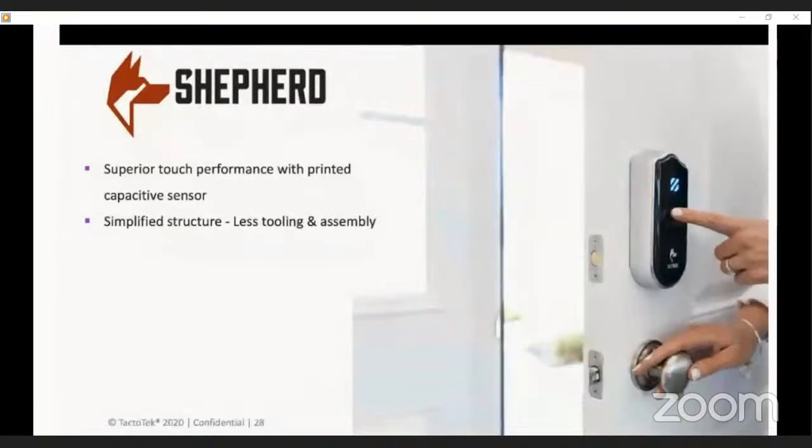But you can see, I mentioned earlier that the cover is actually removable, because what we've done is we've divorced the aesthetics from the functional piece, which we're calling a module that sits right below that cover. If you remove that magnetized cover and you get access to this module, then in order for us to have LED feedback on the surface and a touch sensor, we would have had to come up with a complex tooling strategy to get that done. But with IMSE, because it's fully printed into the plastic with a clean finish, all we needed was to leverage a few connection pads, small and off to the side. We were able to connect to the cover and convey feedback to the user without needing to take advantage of complex tooling strategies.